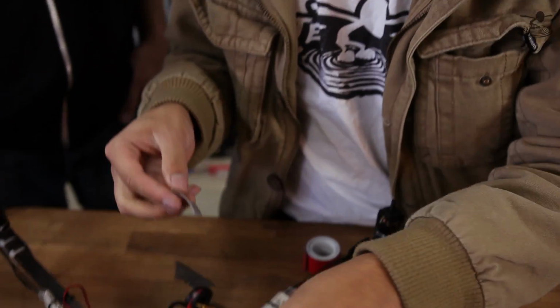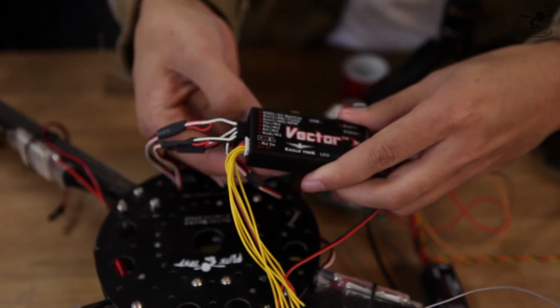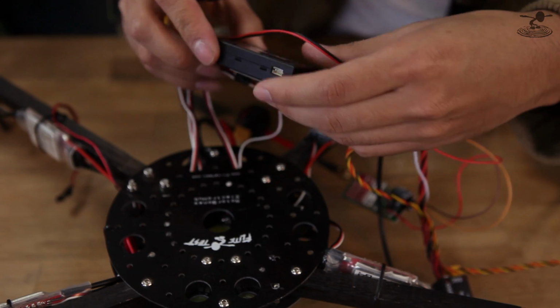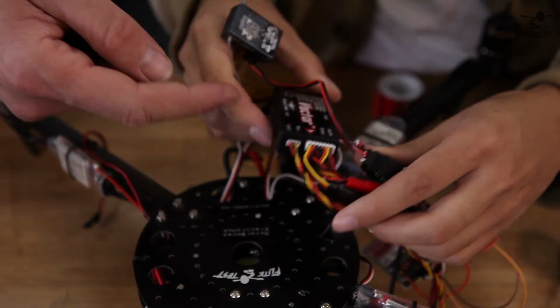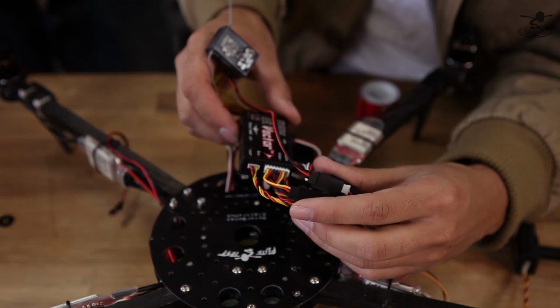Sometimes you can actually double and triple this up and get a little bit more padding. If you get it too thick, it's going to be rocky. Yep. And you definitely don't want this thing moving around during flight. Otherwise, that's a guaranteed crash. Yeah, oftentimes what I'll do is I'll cut it in 4 corners and have it pedestaled on 4 quarters. That's a good idea. And that way it isolates through those smaller areas.